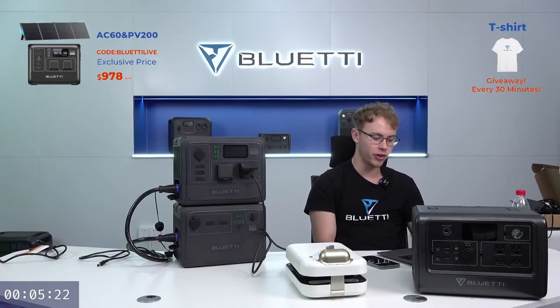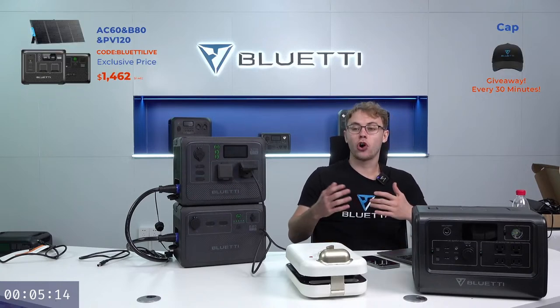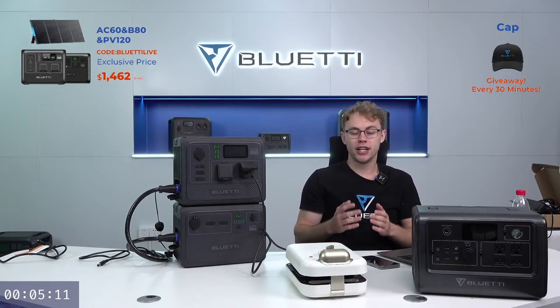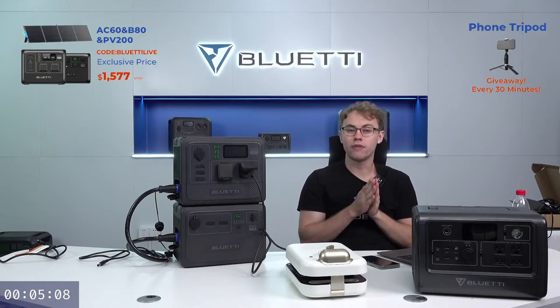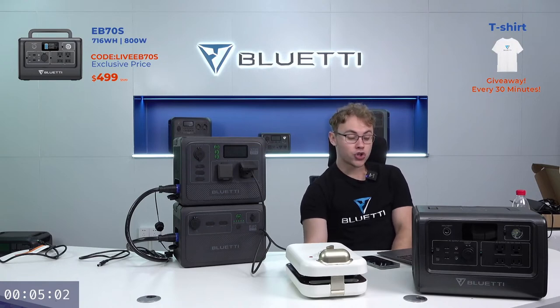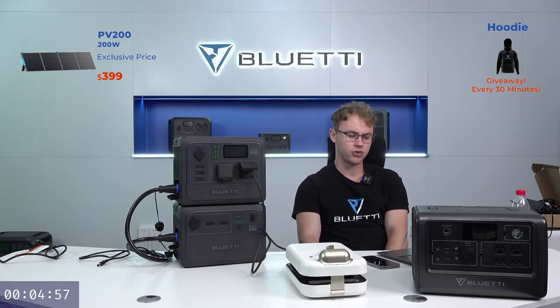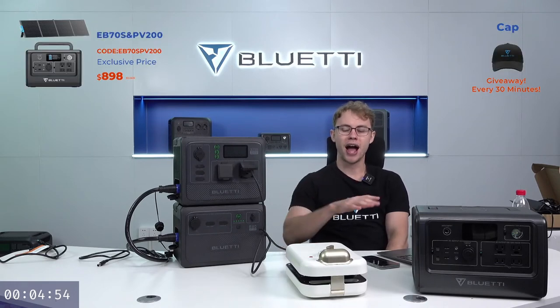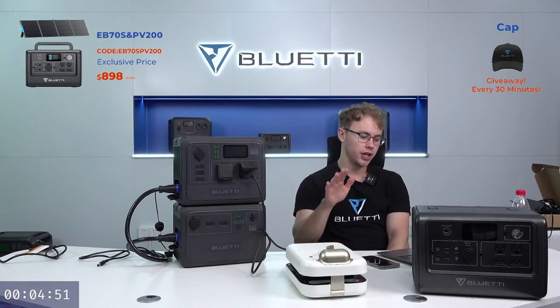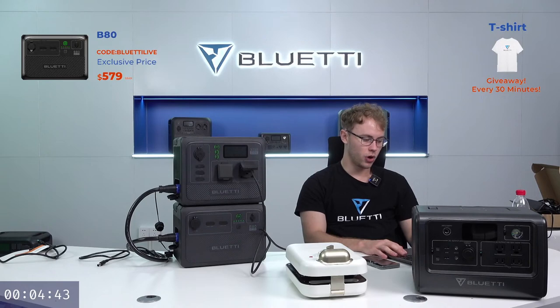Yeah, guys, this is also a very good point. It all is because of lithium iron phosphate batteries. When you're discharging it, when you're using it, you can use it at temperatures down to -4 Fahrenheit, very low temperature. However, when you charge it or store it, you don't want the temperature to drop below freezing, below 32 Fahrenheit. So for discharging, -4 maximum, and for charging, 32. That is -20 Celsius when discharging and 0 Celsius when charging. Okay, next question.